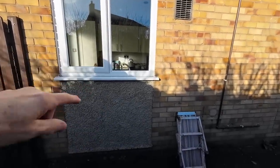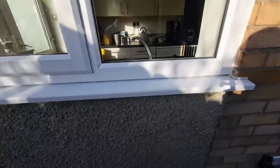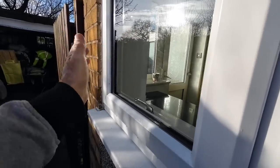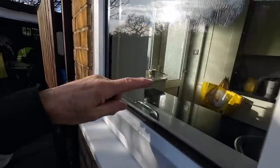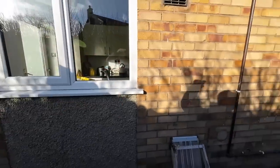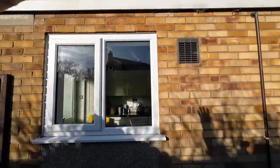And then, obviously the block work's already in up to there, so we're going to carry that block work on up to the top. And we'll also show you what we always do when we're bricking up a window, which is knock the jambs out, because back then they used to return the block work back to the face work and put a damp course in. So that's going to give you a cold bridge now, which we can sort out. So we've cut the cavity back out and we run our insulation through to the cavity, so everything runs right through. So you lose any chance of any damp getting through, and there's a cold bridging strip, that 100 millimetre side of the window that's there now, won't transfer any damp or cold after. And then the lintel stays in, there's no point ripping the lintel out.